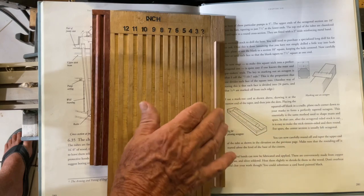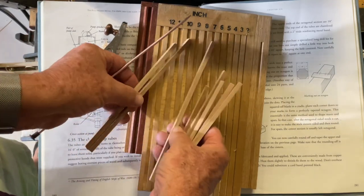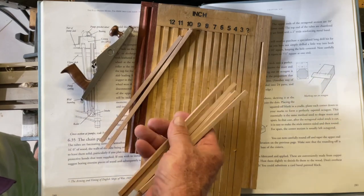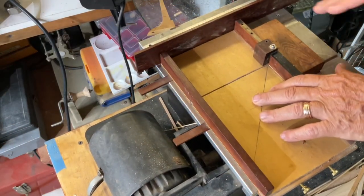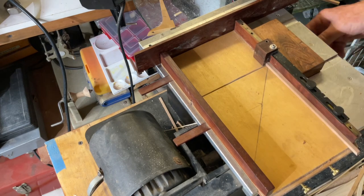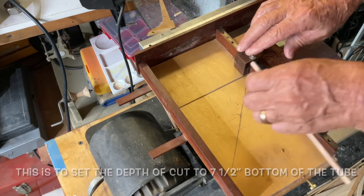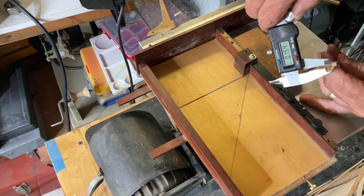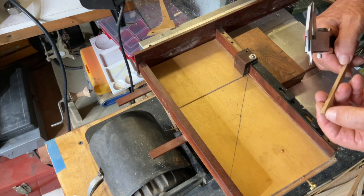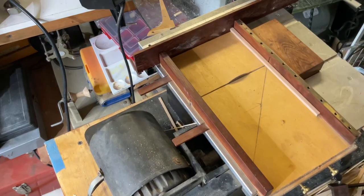As with anything I'm doing these days I make up lots of stock. I'm going to cut the tubes out of juniper, so I actually made 12 pieces — twice what I need — because we're only going to be making six of them. We've set up the sliding table, set the stock to the right spot, squared the end, and we're just going to run these off and mark them. That mark gives me seven and a half inches at the bottom of the tube. Now we'll just cut them to length.